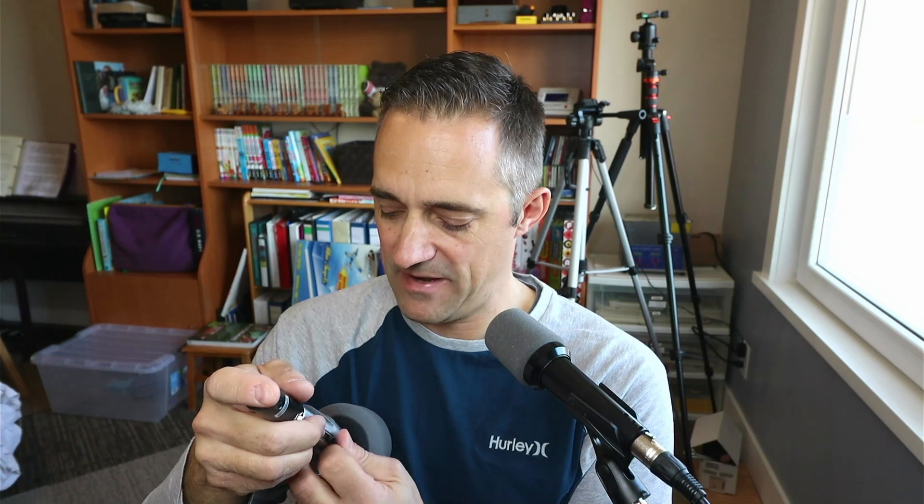I have lots of headroom to boost this even more. It's a little difficult to get this A81WS onto an SM57 — you need a piece of plastic that you can roll up and stick into the windscreen like a funnel. Stick this in, then stick your microphone in, pull on the plastic as you push the microphone in, and eventually you have the microphone in there. Then you just have to get the plastic out of the way — just like that.